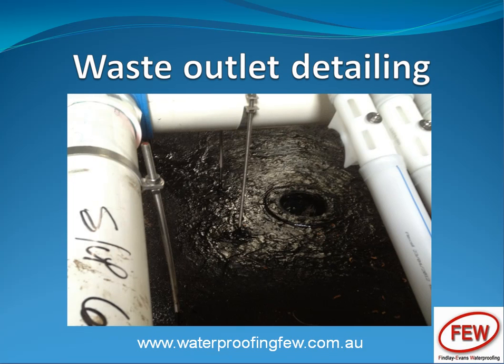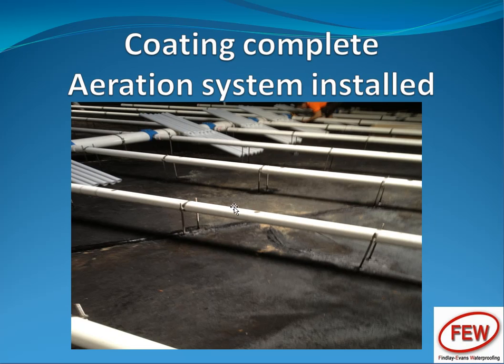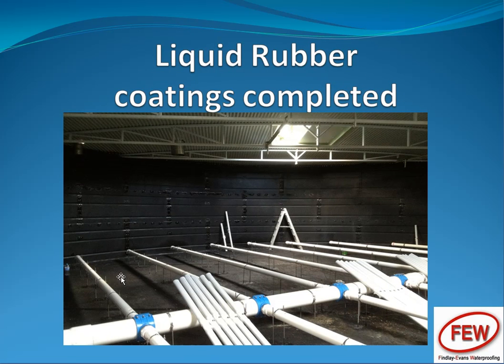This is just the dressing of the central waste point afterwards. There's liquid rubber sprayed over the Geotech fabric forming the base. This is the aeration system going over the top. The third party contractor here is setting it up and there it is basically finished. They just got to finish off the aerator outlets, but the rubber is all sprayed, the base is sprayed and that's ready to go.